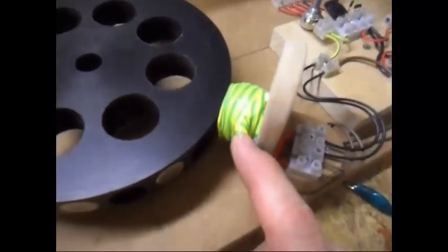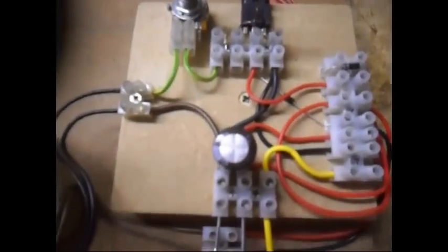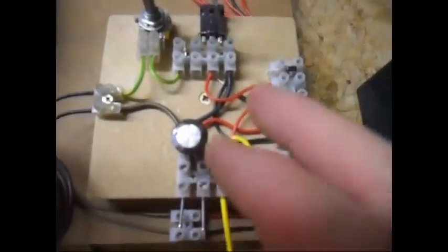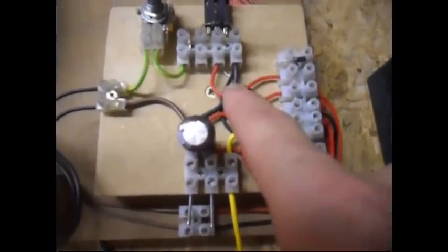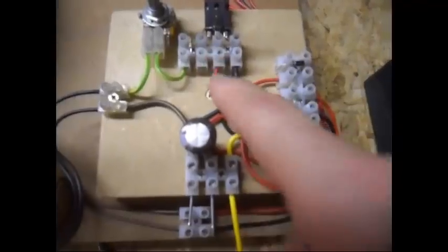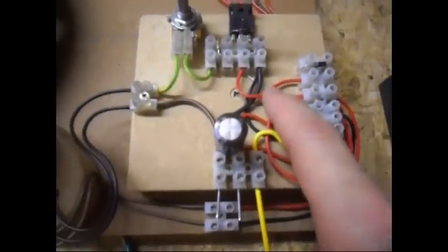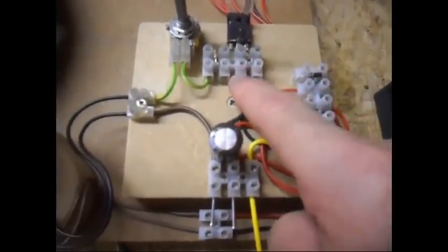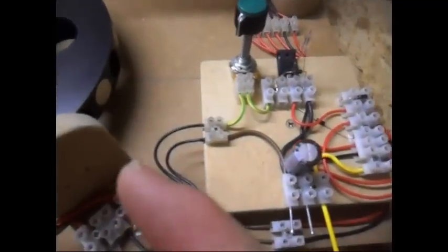This is just a very basic two-strand wire — one run, one trigger, done. The circuit over here is very simple. The only difference from the first one is that here I have a diode just before the collector going to the run coil. With this diode in place you can collect the back EMF and send it right back to the run coil or source capacitor, without the system slowing down. And that's a very good part of it.